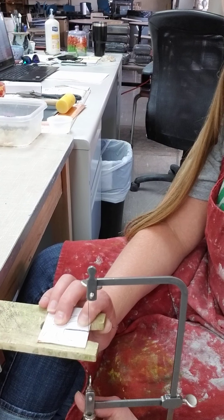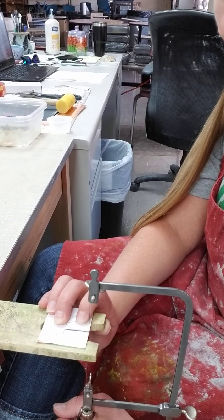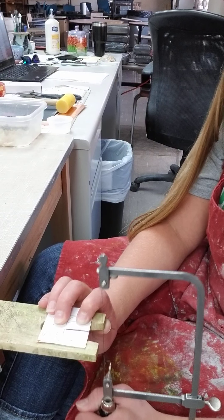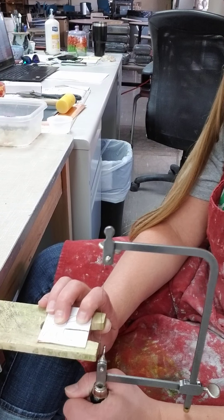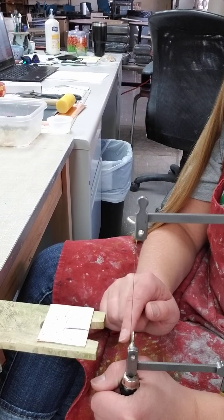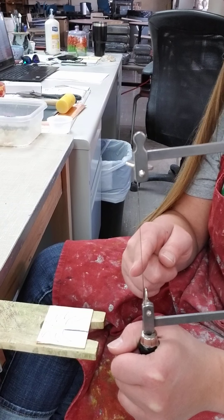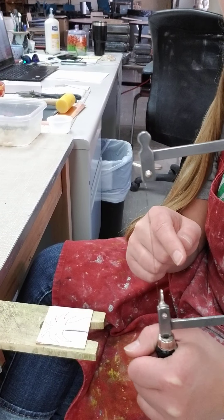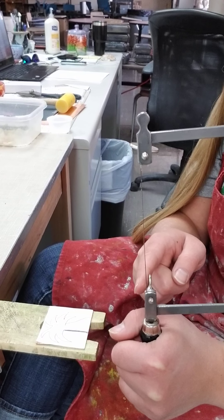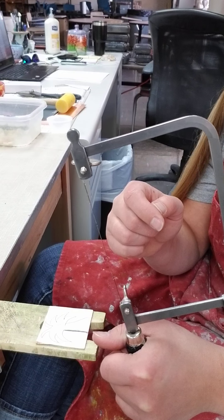I'm in my notch. I'm going to turn my blade to straight up and down, and then I'm going to saw. As you're sawing, it is worth your while to do full pulls. You don't want to saw fast in a small spot because you're not using the entire length of the blade. Also, you can't push your blade into your metal — you need to let the tool do the work. If you hear a hard binding against your metal, ease off pressure. Pushing too hard only dulls your blade; you're not cutting any faster.